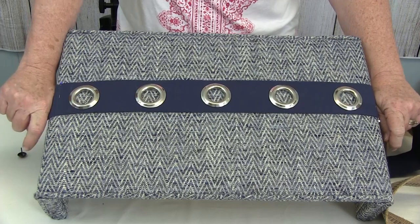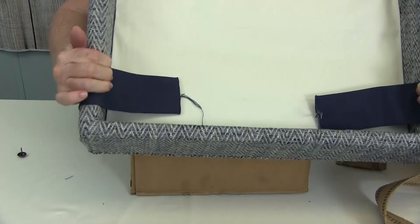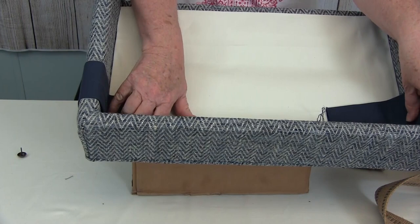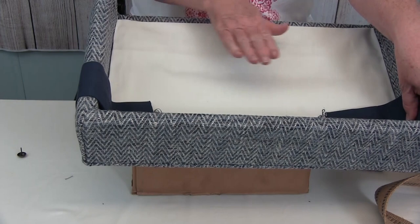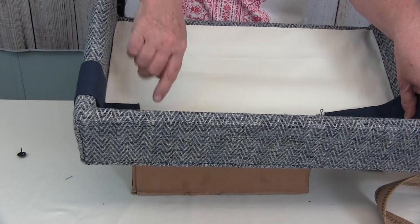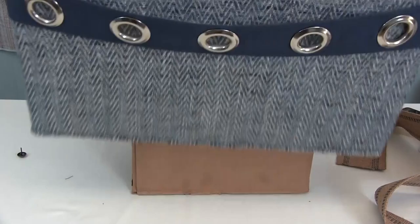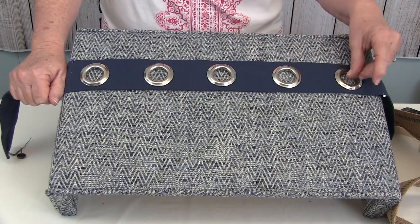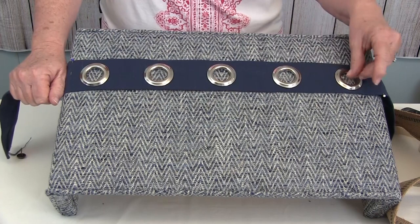To attach the banding, find your location and get it centered, then turn your cornice over and pull it nice and taut. Bring it to the inside and staple along the crease where the leg meets the face, on both sides. Then attach your lining on top. If you've already added the lining, just turn the piece under and give it a couple of staples. Along the face, once positioned and measured, take some fabric glue and run a bead underneath the top and bottom edges to help keep it in place.